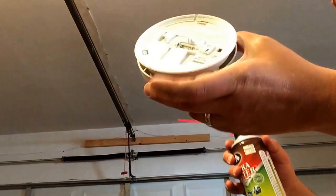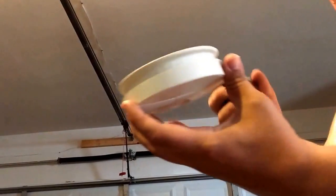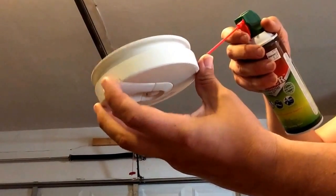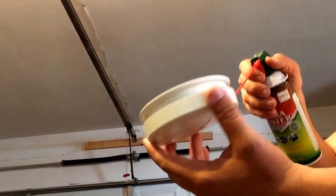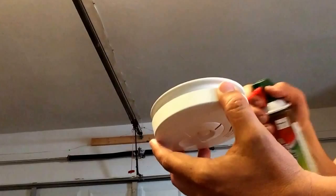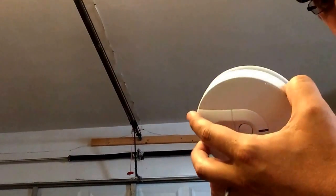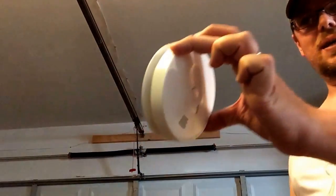This is old technology — it uses particles in the air to tell you if there's a fire in your house or not. This is what's been happening with my smoke alarms: all that dust has been making my alarms go off. By blowing it out, I'm removing the particles that would cause the fire alarm to go off without there actually being a fire.